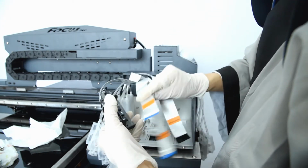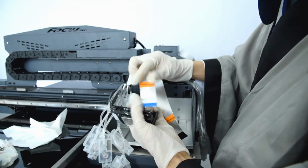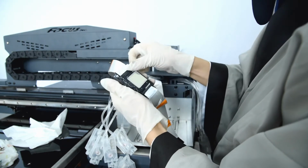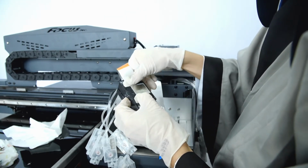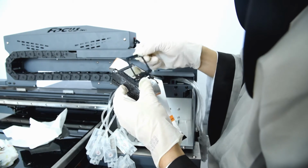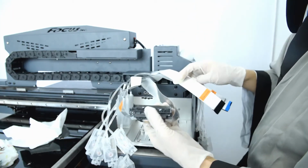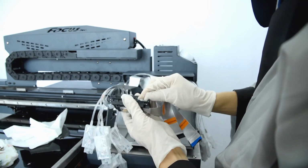Then we find the right white print head cable, named right white R1. We install it the same way. Check the pin first, then install it to the print head, make it flat and fasten. Be sure where the fastening ring is installed. So we find a screwdriver and a screw. Find a 4 screw and put it inside the hole.